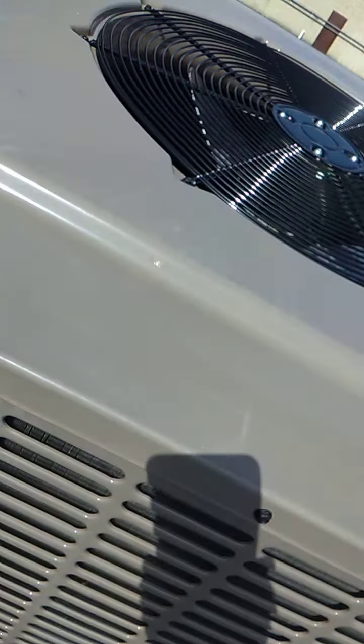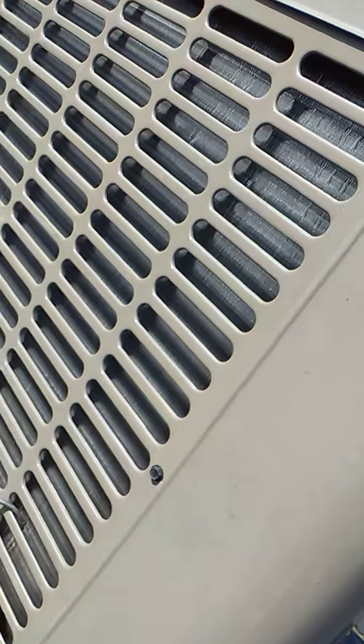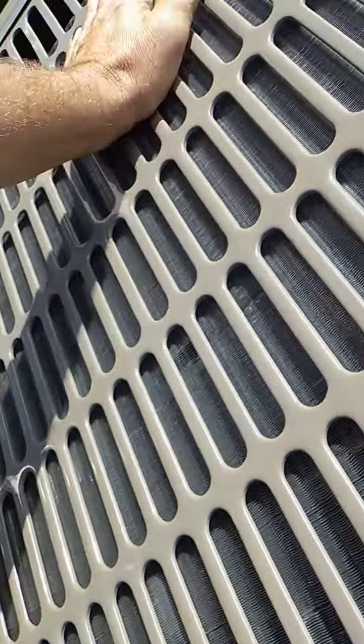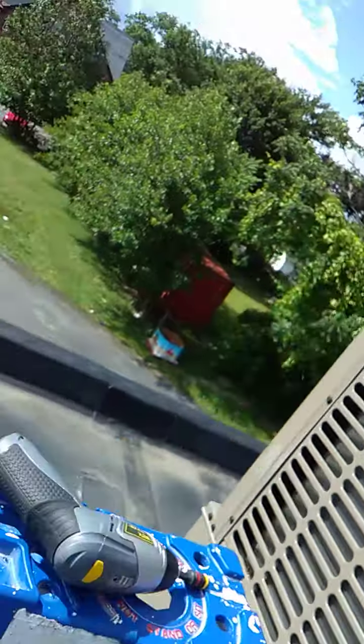So I've got to take off the condenser motor top and slide it over to try to get to this coil on the inside — to see if it's going to be accessible from the inside easier, or take this panel off from the outside. I'll have to remove some of these fins on the coil so I can braze this leak. It's the only way to fix it.